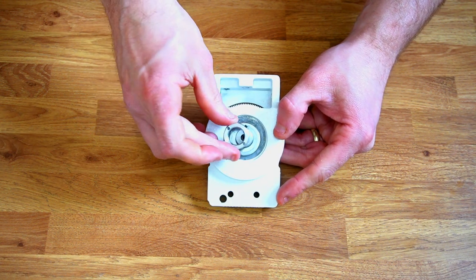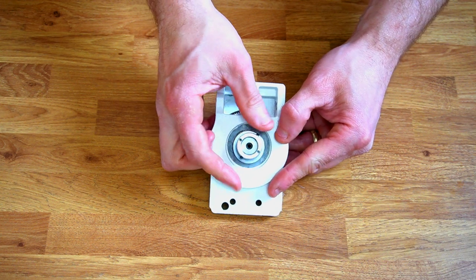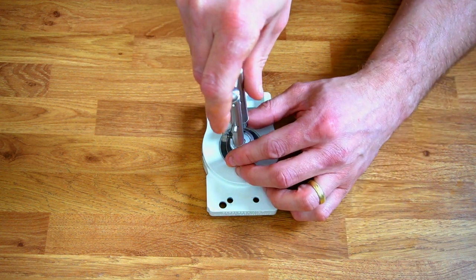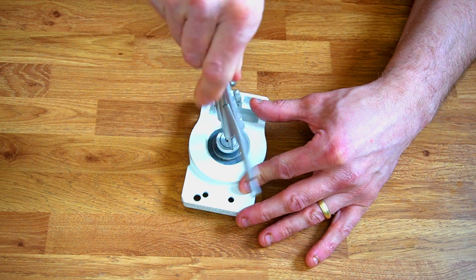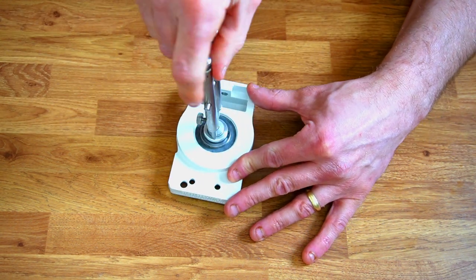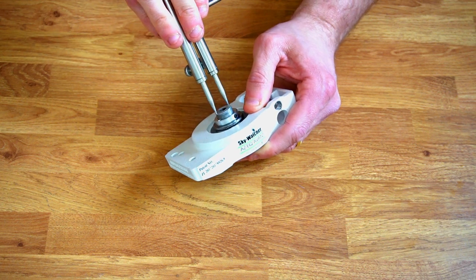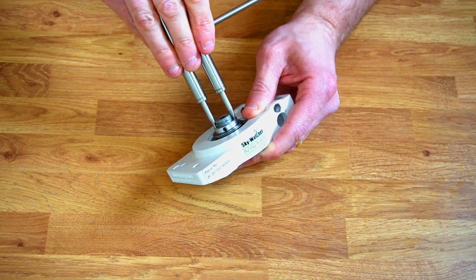We then got the lock nut and we screw on the lock nut. Feed it in with a couple of turns. And then get your special tool, like so. And we're just going to tighten the lock nut. Now we're going to do the preload. We're not going to do that yet, but we need to adjust the bearing. So we'll just nip it up for the time being, but don't over tighten it, because we need to preload that bearing, and we're going to do that on the mount. So all we're doing is just... That's it. Back it off.